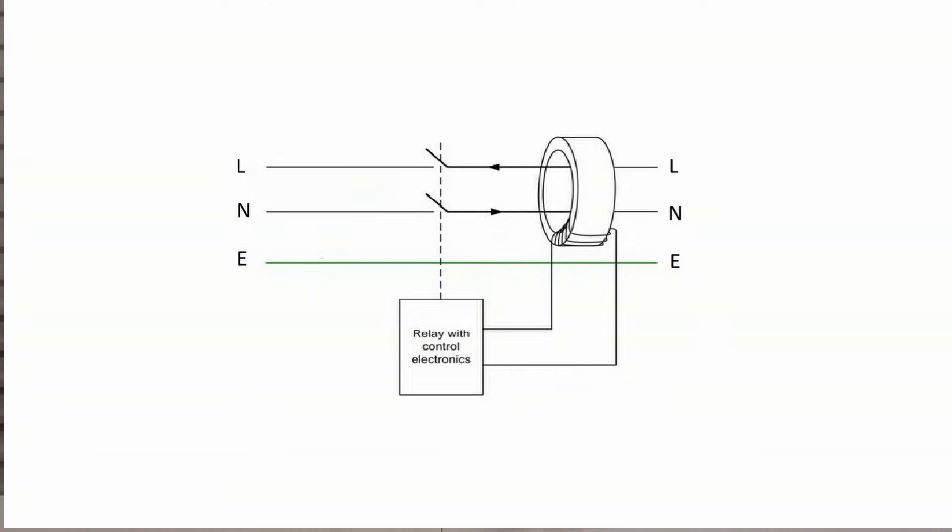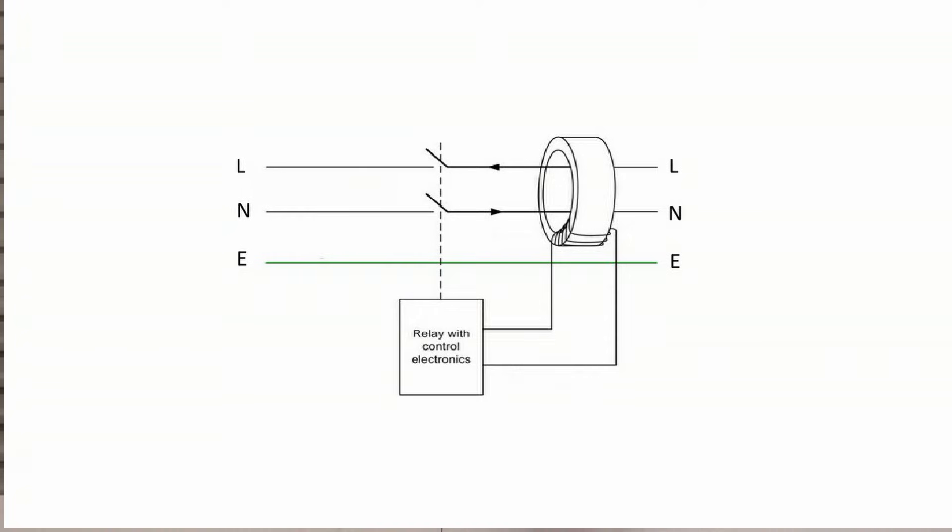Here's a bit of a diagram. As we can see in the picture here, current flows through the live and the neutral conductors. The RCBO continuously measures and monitors the balance between these two currents. If there's a leakage — say to a damaged wire, water, or a light fitting — the RCD will trip. It will see an imbalance and trip the circuit.